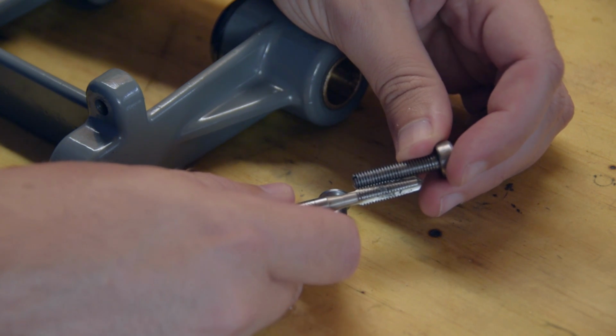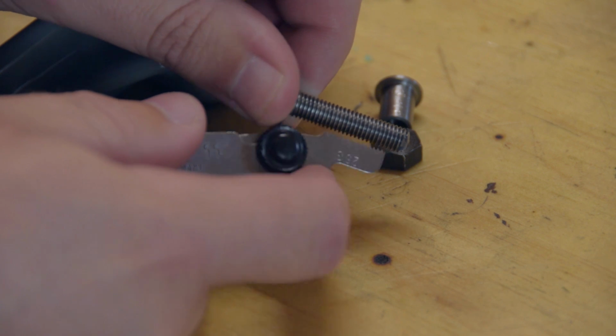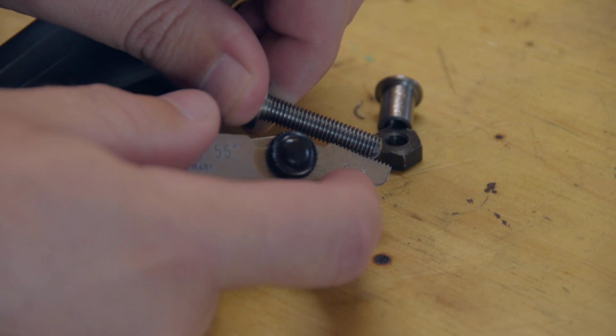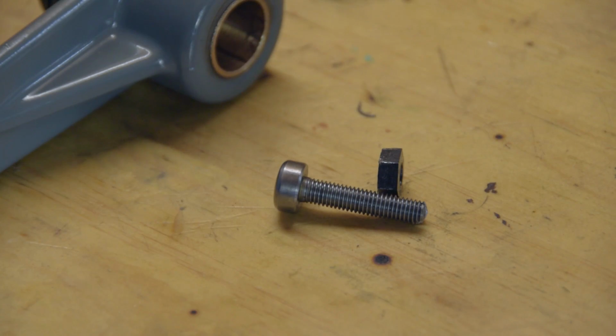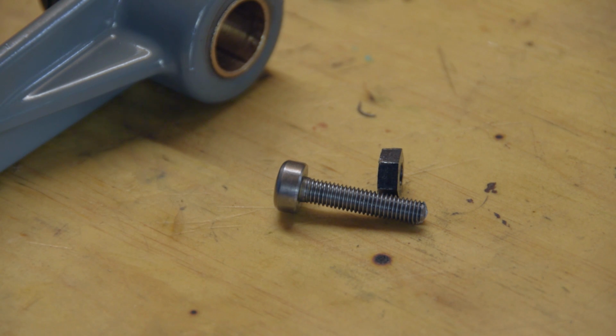The tap seems to match up with the screw thread, and the pitch gauge confirms 26 TPI, but neither fit perfectly. I realised that what had happened is that the lock nut has been over-tightened and the screw has actually stretched in one spot. This will be why the thread in the casting was stripped. When I reassembled this piece originally, the thread just felt a little tight, but in actual fact, the stretched thread of the screw would have been damaging the aluminium thread on its way through.